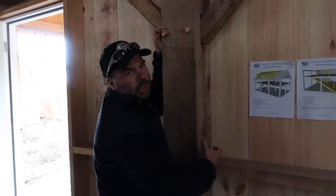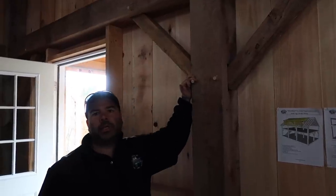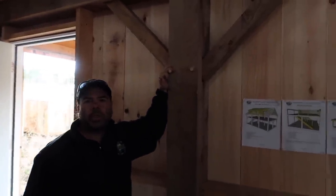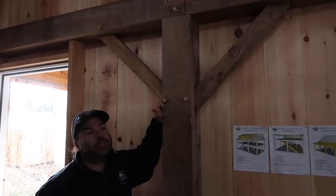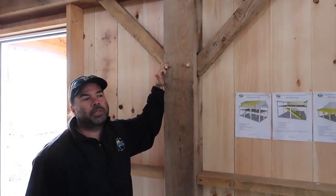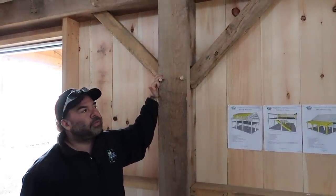You can put in a 6-inch wall with high R-value. You can use any type of insulation you'd like — even something more alternative like cotton, wool, or hemp. You could use structural insulated panels — SIPs could fit on there. You could also use traditional fiberglass. So a lot of different options exist depending on your budget and your R-value comfort level.